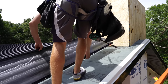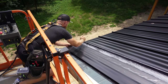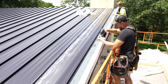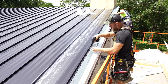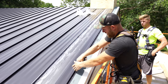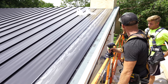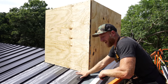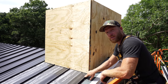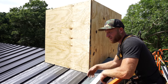Boom! Look at that. Pick it up a little. Ready? Pull it up - one, two, three. Nice. Someone asked how this panel performs in windy conditions. Exceptional, because there's nothing underneath of it. There's no uplift - I mean the whole roof system has to move. Alright, so now that we have these roof panels here, ideally you want to have this last piece. I'm actually short this piece because there was a miscalculation - this roof was figured with a one-foot overhang and we have a two-foot overhang. I'll have to get another piece for each side.